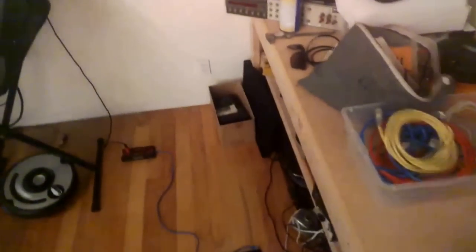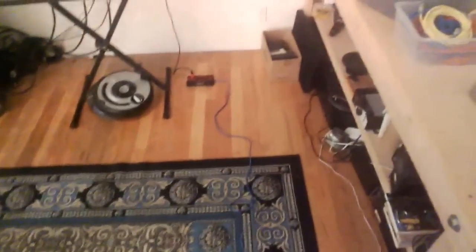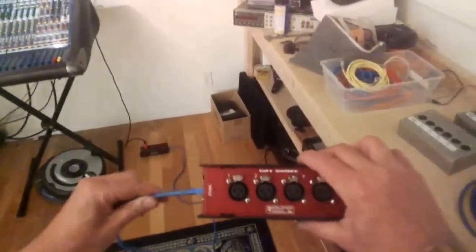You can also use the Cat Snake on unshielded cable for very short runs. If you use unshielded cable or for line-level stuff, you can get away without shielding because the twisted pairs are fairly high quality inside the Cat5 cabling.